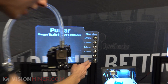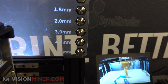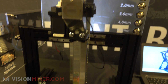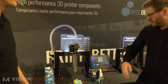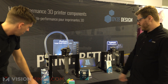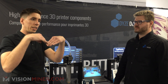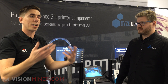Check out the nozzle sizes here — they've got flat tips just like we like on smaller nozzles, but these are beastly. The nozzles shown here are the standard version for Cartesian or gantry machines, but they also have the same nozzle sizes for non-planar applications — those have a pointy, elongated tip to give more clearance. Just like an E3D, depending on the angle, a lower angle limits how far you can tilt, while a higher-angle nozzle lets you go straight up and down without hitting the part in non-planar printing.